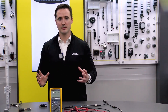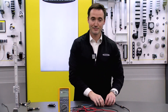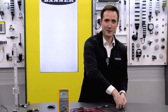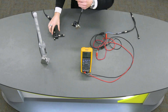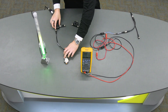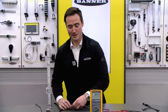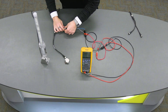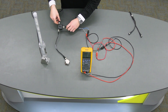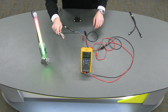This can all be done with very simple M12 connectivity. All you need is a lighting product, the converter, and some standard M12 splitters. I'm going to take this sensor and plug it in on one port of the converter that's connected to our light. The cable going to the PLC I'll add on the other port — so we're not disrupting the PLC. The signal is still going back to the PLC, but we're just overlaying a lighting product with this converter. And lastly, on this port right here, we're connecting a light. So we've got the PLC, the sensor, and the light.